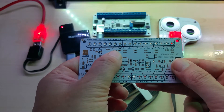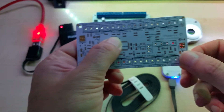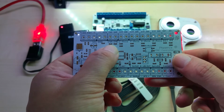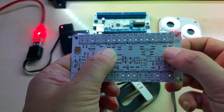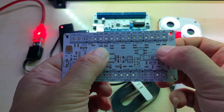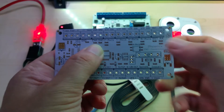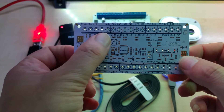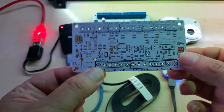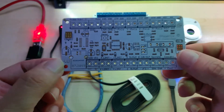Let me tell you about the updated PCB quickly. It now has an enable LED — sorry, my speech is a little slurred, it's late at night as usual. It also has an LED for the A4 output, digital or analog, which is the mist coolant with G-code M7. I did away with the switching circuit, so this runs on 24 volts now — sorry, I misspoke.